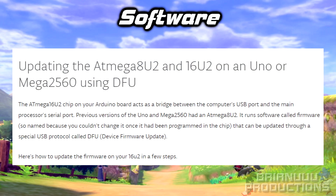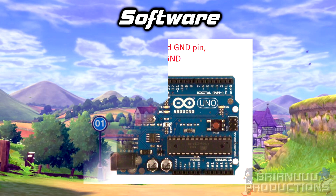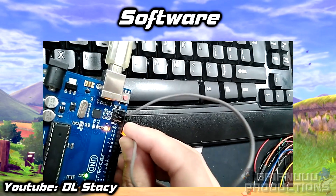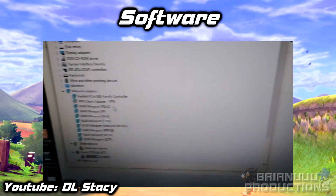For Arduino, you will need to flash your board to DFU mode before you can program it. This is where the jump wire comes in. Plug your board to the computer. Next to the USB port, there is a 2x3 pin arrangement. The top left is the reset pin and the bottom left is the ground pin. You will need to connect them together. If you have the female-to-male cable, you can also use the ground slot on the top row. When you connect them, disconnect — you should be able to hear the computer disconnect the device and then connect again.